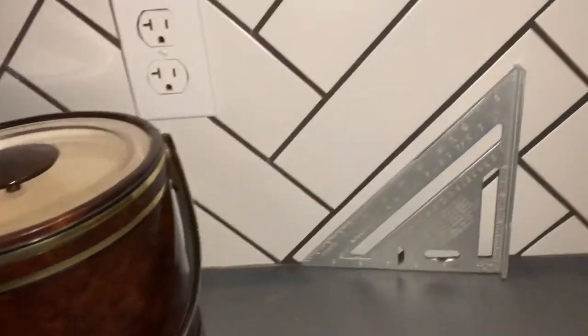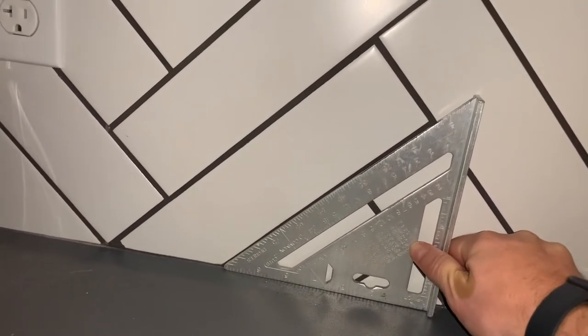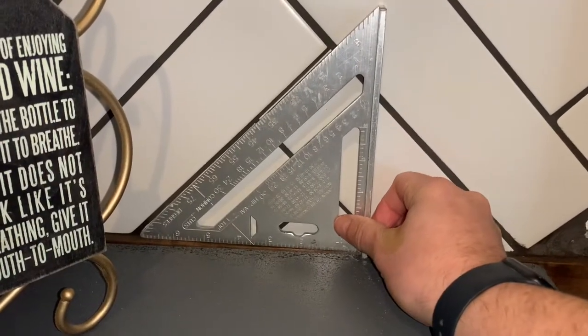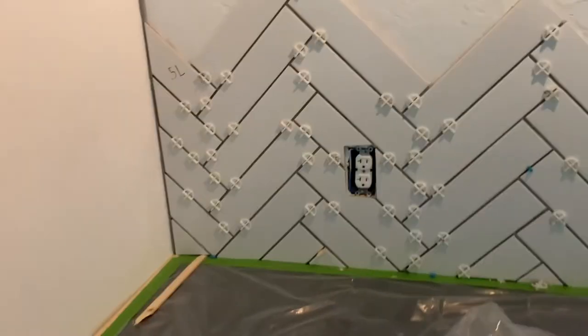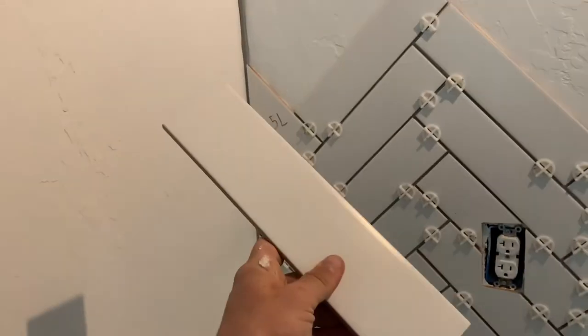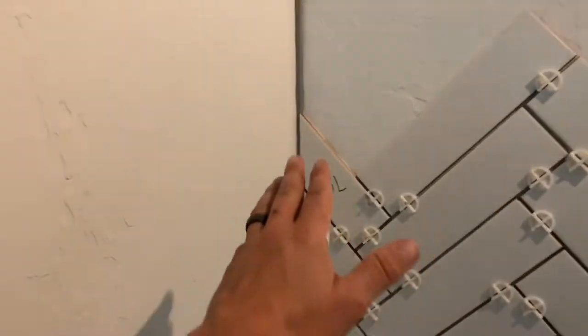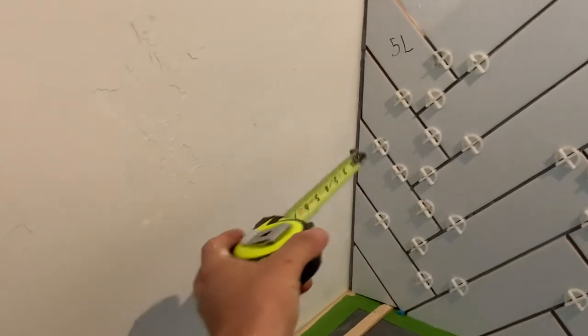When starting to lay the tiles, I always recommend putting your 45-degree square down and letting the first piece rest against it. That's a good way to start — whenever you're starting a sidewall, that bottom piece can just rest right there and then you tile on top of it until it dries. I went from center out. When you hit a corner edge, don't try to conserve pieces — cut whole pieces for that edge so you can flip them to the adjacent wall and use the leftover piece there.